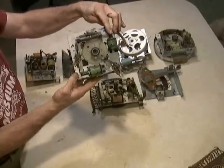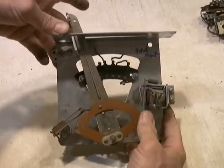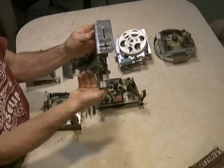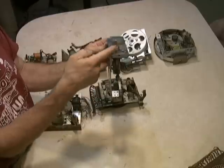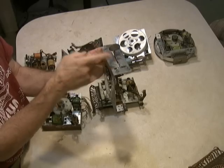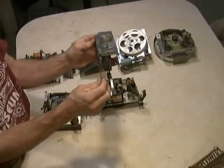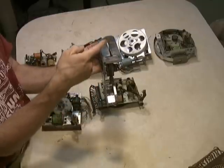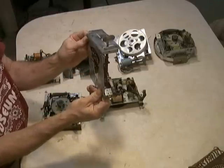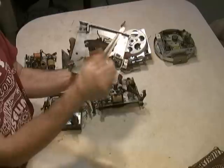The last example I've got here is in Gottlieb games - this is a playfield mounted stepper called a varitarget. A lot of people don't consider it a stepper, but it really is. On the playfield, you take a shot and the ball hits this target, advancing it a certain distance scoring anywhere from maybe 1,000 to 5,000 points, and then it resets the stepper all the way back. So this is a total reset, but instead of having a solenoid advance it, the mechanical ball action hitting the face of the varitarget causes it to move. Then the relay coil makes it reset. Pretty neat little device - something Gottlieb came up with.